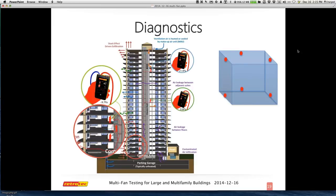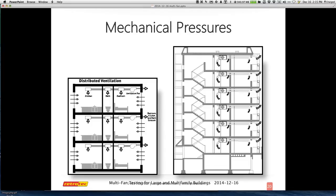This is actually a very fun exercise with a large building — someone else sets up a bunch of tubing so you can diagnose the structure. We'll also be covering a variety of testing standards, from ASTM to Army Corps of Engineers and others — when do you need them, which one you're going for, and how they actually apply. Sometimes you can only depressurize versus pressurize. What are the conditions required versus what you actually can do? What are the limitations of wind and temperature?